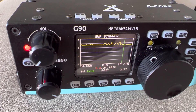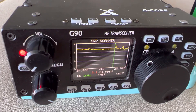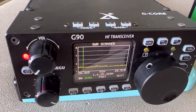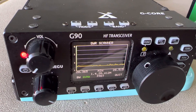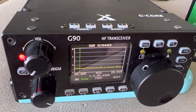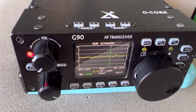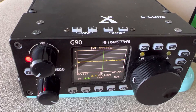12 meters, a little different story. Still tunable, but you can see we're getting out of range here with 12 meters. 10 meters is looking good — we can use 10 today too. I like that. We can use the ATU and make it happen. Obviously some of these bands are close — you could operate without an ATU if you'd like. Last but not least, 40 meters — kind of up there a little bit, but also tunable with an ATU. Alright, let's quit checking SWR and get on the air and make some contacts.